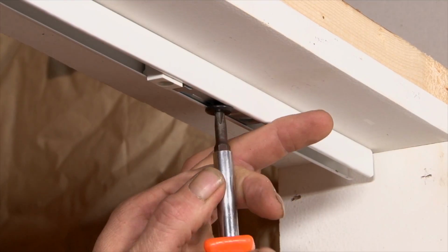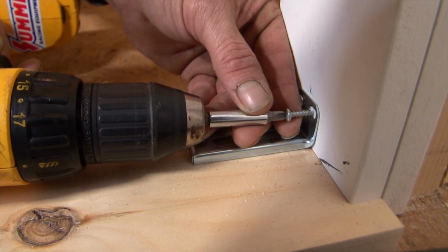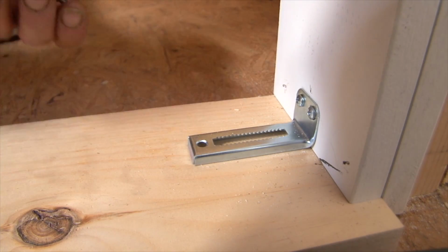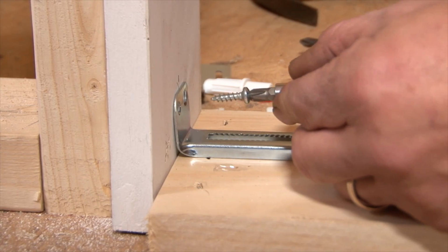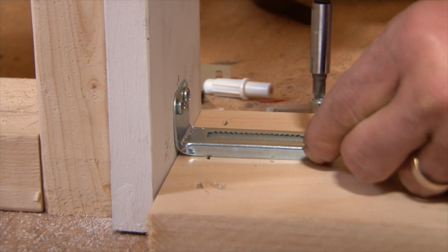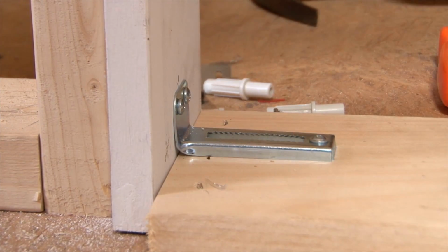Then use a screwdriver to loosen the screw in the sliding hinge bracket set. Mount the bottom bracket to the wall jamb using 2 round head screws so the center of the serrated hole is aligned vertically with the center of the top track. Be sure the bracket is seated firmly to the floor, then fix it using 1 long screw. Use this screw for wood flooring only. Press down into the carpet if necessary.